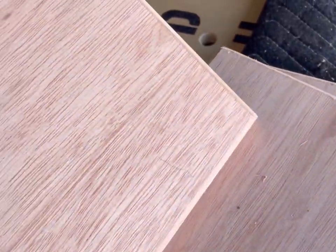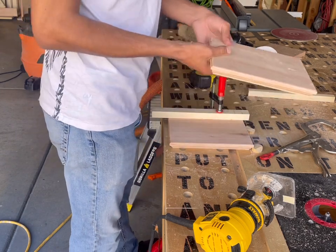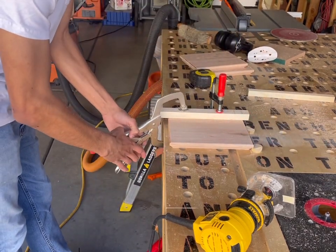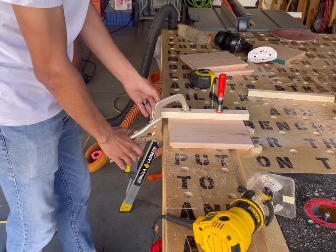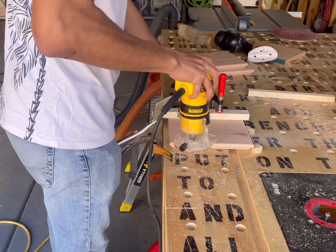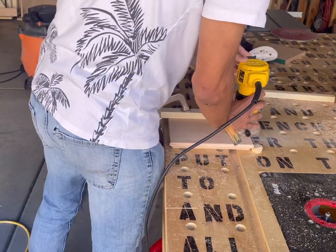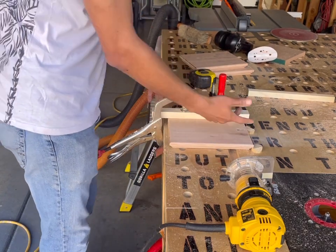I just made a few of the keyholes — they came out alright, look pretty good and centered. The way I have it set up: I have a clamp and a spacer, and then another clamp to hold it in place so it doesn't move. I have tape here so I already know exactly where I'm going to land it against the wood. I'm just puncturing it in and then lining it back. Just like that, I made my keyhole — I have two more left after that.